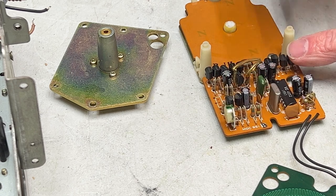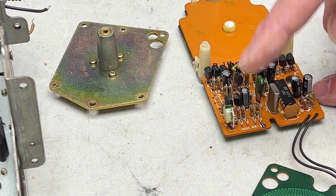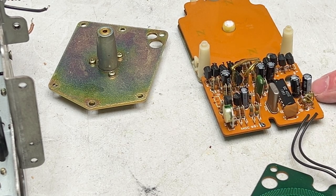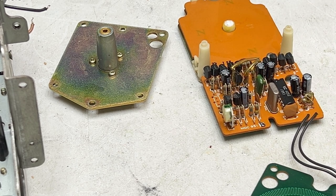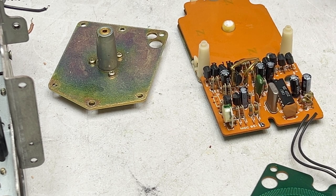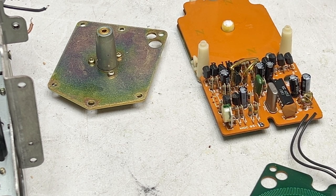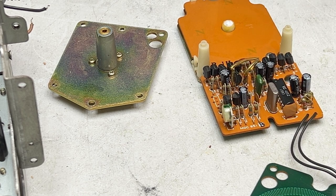Now, I'm nervous about this control. I don't know what it does, and I don't know how to align it, because the factory service manual says nothing about it. So I'm hoping it's good where it is, because if it's not, who knows? Could be a duty cycle adjustment for the capstan control. But I'm not going to touch it unless there's something obviously wrong, because, again, I don't know how to align it. And that was the problem I had with the TCK666ES: I moved the duty cycle control on that one and had to go back in and realign it. And on that deck, I had service information, so, yeah.